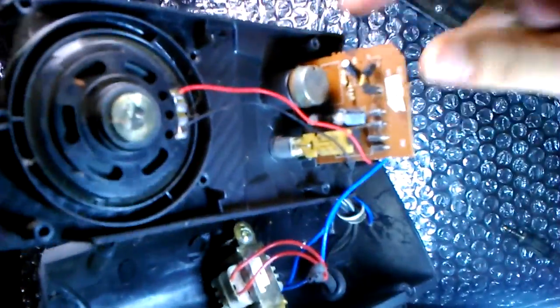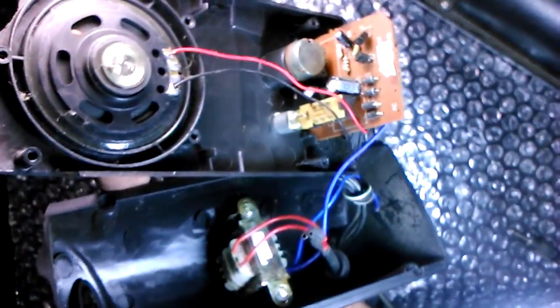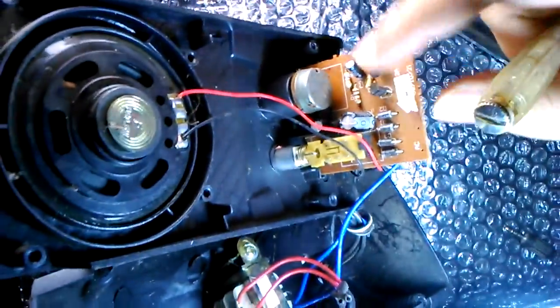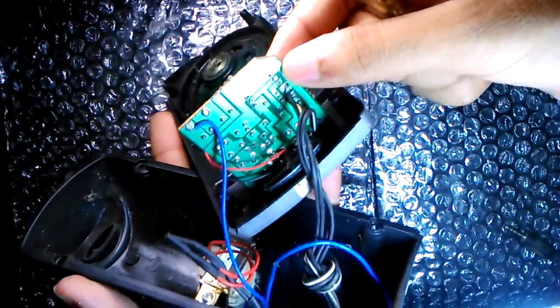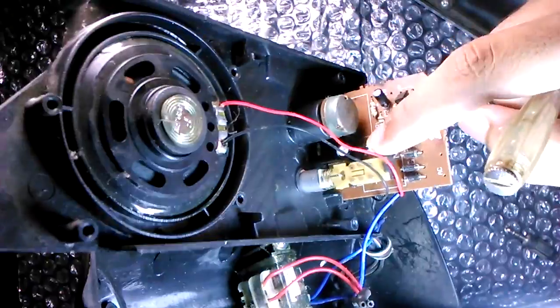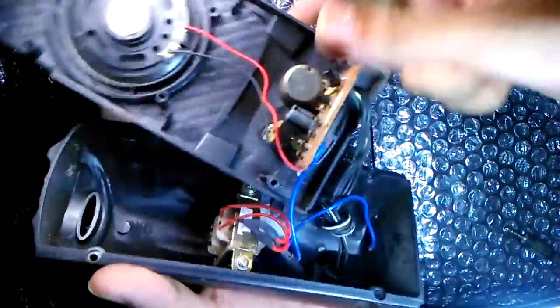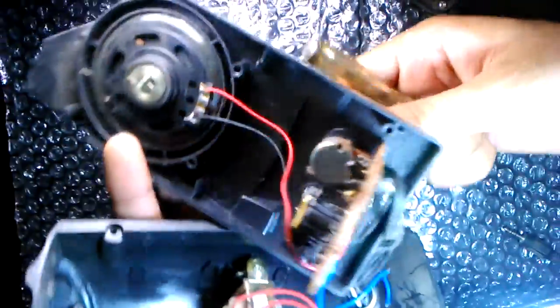Looking at the amplifier circuit, they do have a transformer here so I'm guessing it's a nine-volt transformer. That is the only active electronics they have. Basically what they did is use the most basic amplifier circuit possible — this is actually a two-stage common-emitter (CE) amplifier based on nothing but two transistors and a few resistors for biasing, some capacitors. I believe this one is for filtering, this one is the coupling capacitor, and a potentiometer to adjust volume. I don't think that's a stereo potentiometer — no, it's not stereo at all.